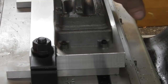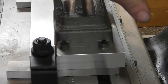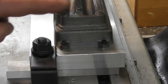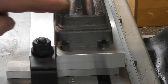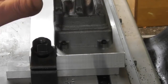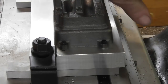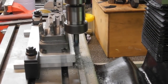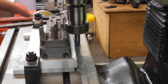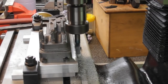I know this is running square — it was clocked square — but now I'm going to machine this aluminium face so I have a reference on the aluminium that is square to that clocked face. I've rechecked the face now that it's bolted back down — it's as square as I'm going to get, within about two thou across the ribs. I've got just enough room for the cutter without needing a long-series end mill — I'm just going to dust off this face until it cleans up, making sure I'm missing all the bits of casting.